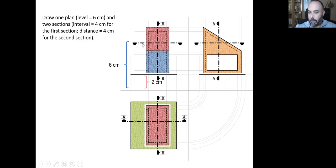or we can measure a four centimeter height to find this line — that's the position of our horizontal cutting plane. We need to indicate it by drawing a very thick and black line over our sketching paper, at least twice the size of the lines we use to indicate surfaces. We need to put this line over the front view and left side view, and put little triangles to indicate we will be looking downwards.